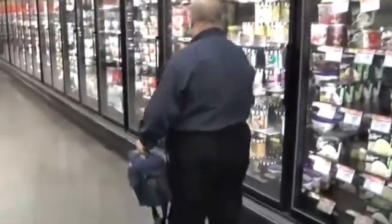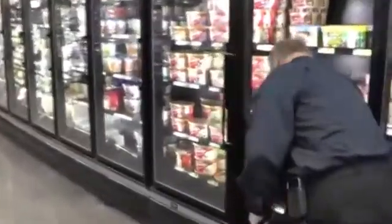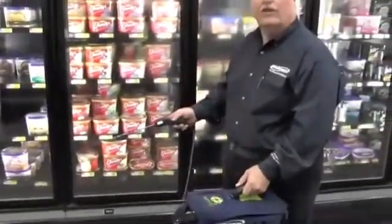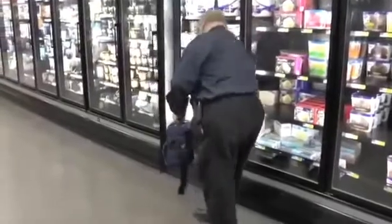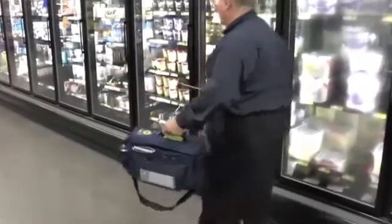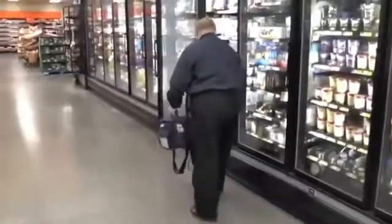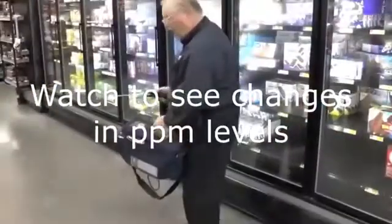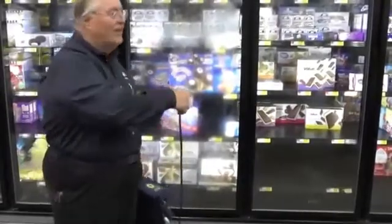A maximum PPM value of 287 indicates there's a pretty good size leak in these cases. When I came out into the ambient air, the reading dropped. I'm going to walk down a couple more case doors to see if I'm getting closer to the leak. That value is a little bit lower... about the same... now I'm up to 390, getting a little higher... 478... now I'm down to 378. So the leak is going to be in this area right here — this is where my highest value was.